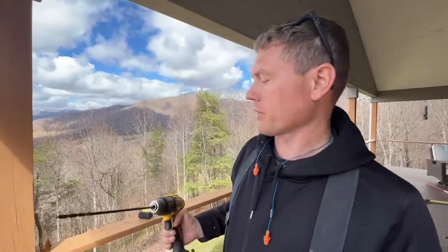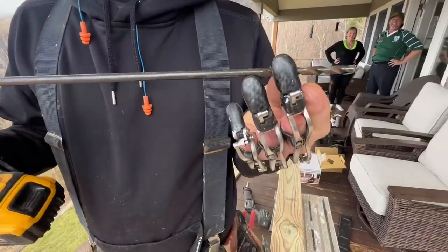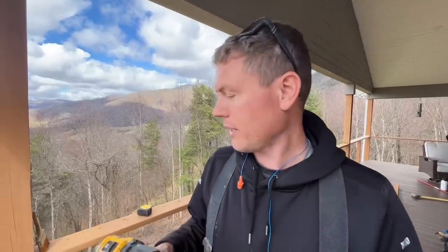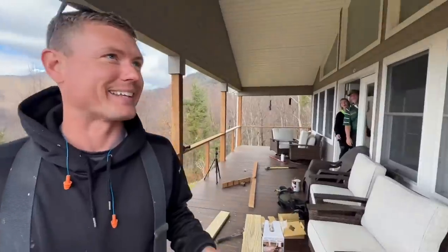It's time to drill all the holes in the posts for the cable to run through. We're using this long bit — it's a quarter-inch bit for the eighth-inch cable. I've heard this called an aircraft bit. There's no aircraft about it, but maybe some smart person out there can tell us why they would call this an aircraft bit. It'll go all the way through a post, but we are going to drill through both sides of the six-by-sixes. Even though we could drill from one side all the way through, we found that it's more accurate — it'll sort of wander. You could get sideways or up and down, way off, way fast. The homeowners are watching!